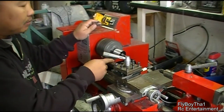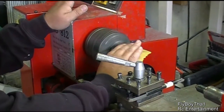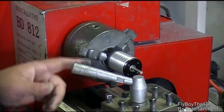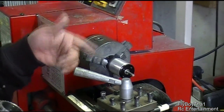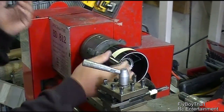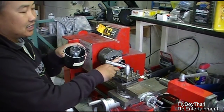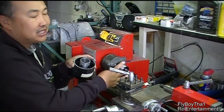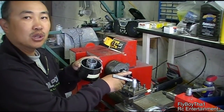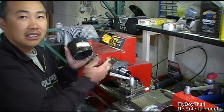Sometimes the motor was not machine-perfect, so a little bit oversized — I just clean up the black anodize so it should be able to fit in the shroud. This is two different machine shops, so I only follow the dimensions the factory gave, but the motor mount machined by the factory is not consistent, and the anodize also builds up to different thicknesses. So if you run into that problem, just clean up the black anodize and it should fit in the shroud.